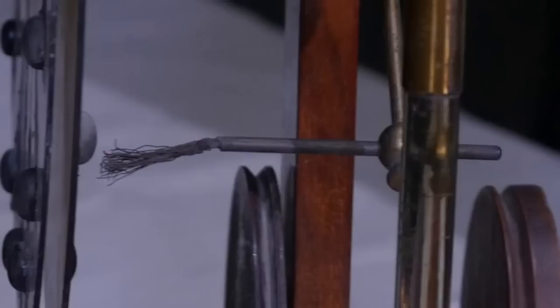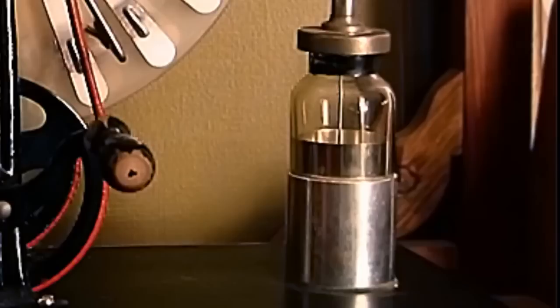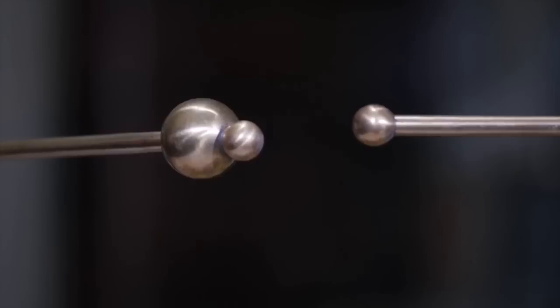And this, in combination with the action of two sets of wire brushes set at right angles to each other and touching the metal sectors on the plates, has the effect of separating positive from negative charge and multiplying it. The charge is picked up by these metal combs and then conducted to the Leyden jars, which are capacitors. And once the electrical charge has built up to a certain level in the capacitors, there is a lightning-like spark as the charge discharges between the ends of the adjustable electrodes.